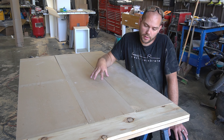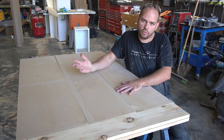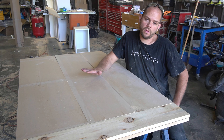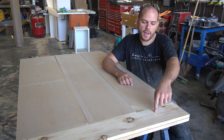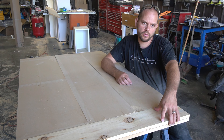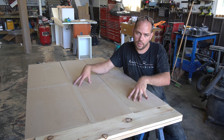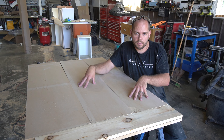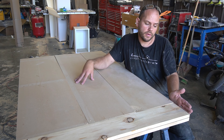This is actually the top piece of our countertop — this is the bottom side of it. I'm using a bunch of scrap MDF I had around the garage, but the bottom side is a full piece so that we have a nice flat surface to glue the laminate to. I'm adding a piece of wood on the edge where I'm going to connect the waterfall edge, so I wanted some nice structure. This size is a little bit bigger than what I need, but I did that so that after my glue-up I can take my track saw and square off all the edges, so when I go to put my laminate on I'll have nice clean edges.